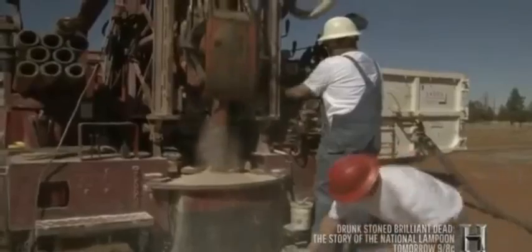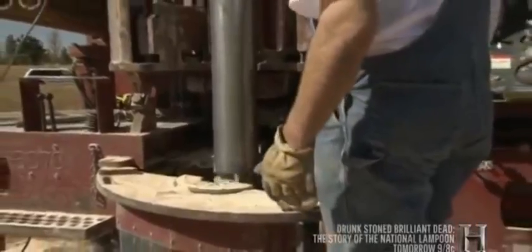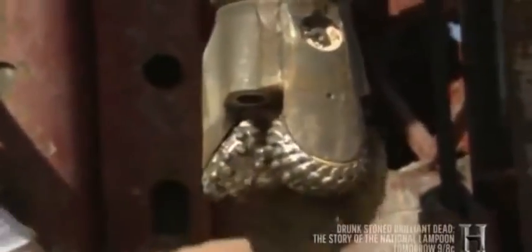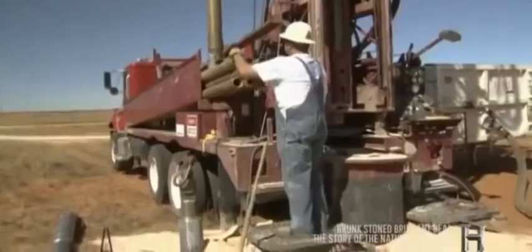Rotary drilling is the method used to drill 85% of all deep wells in the United States, including this one being drilled by the Eads team. They sometimes employ a percussive element, like the downhole hammer. One hour into the drilling, they've passed the rock layer and change the drill bit once again. This is our drill collar we run in when we make our final trip to go to bottom.